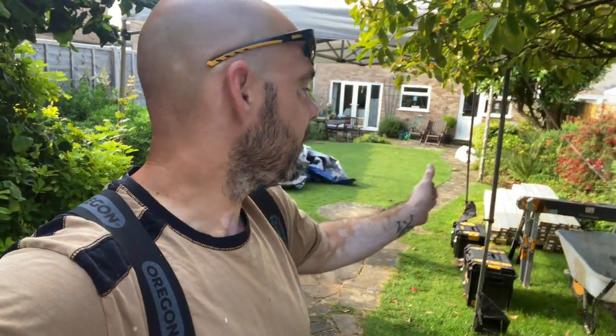You don't need C24 for your walls, okay? C16 is a standard structural wood that's absolutely perfect. It just so happened that when I went into Wickes Friday, they only had C24, so I picked it up. I know that some people trip over that and they're like, do I need C16, do I need C24? C16, done, easy peasy. But that's what they had on the shelf, and I had like 50 lengths I could just put in the back of the van. So that's pressure treated and C24.